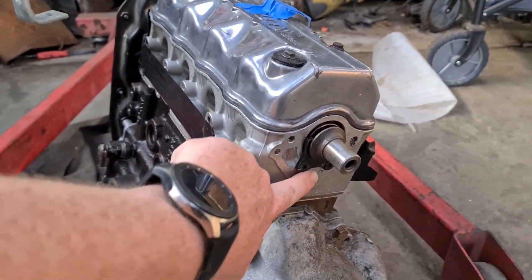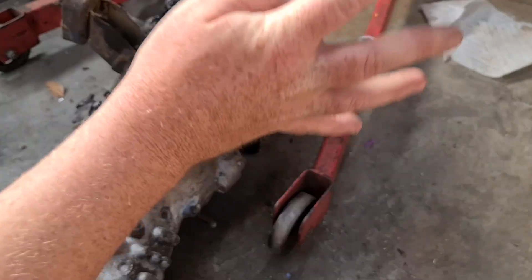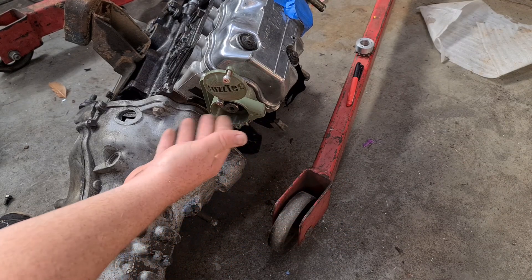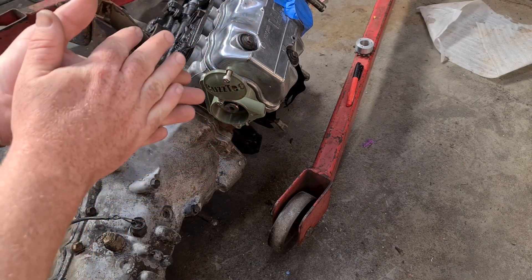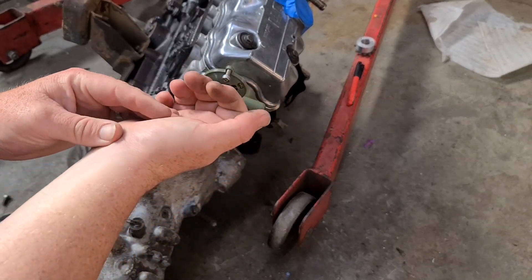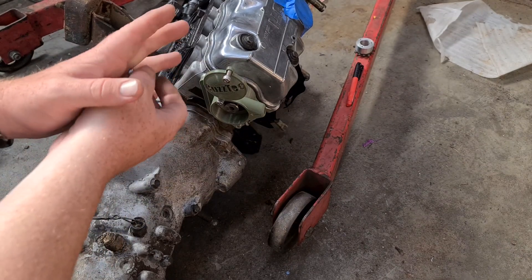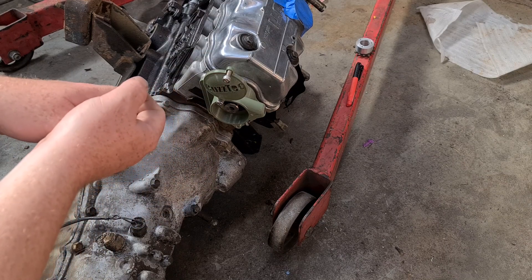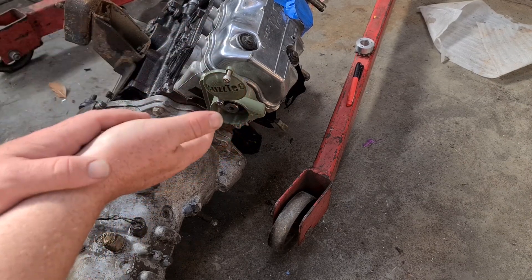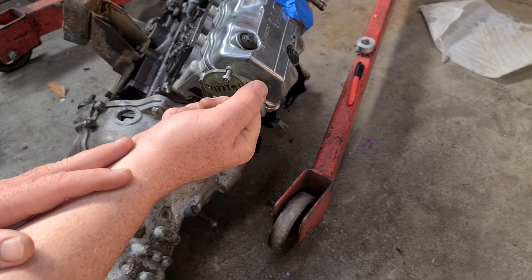So the engine is out of the car now, so what I'm going to do is tape up this hole here and I'm actually going to shorten the camshaft. Timing mark - so this was something I put in a little bit later when I was at the design stage, thought it would be useful, turns out it is. When you line up these marks it will give you number one compression stroke top dead centre, and it will set the blank missing tooth to 180 degrees out. In my ECU in the speed window, you just put that number in and Bob's your uncle. Hopefully other ECUs are the same, but otherwise all these points are known, so it's easy to make another template and just cut another trigger wheel to suit whatever timing the ECU needs, or if we change ECU.